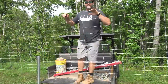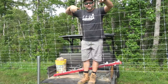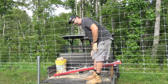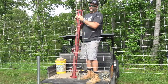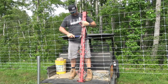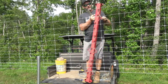Up we go. You can see how high this wire is — it's pretty bouncy and it is super duper tight. There's no way — I weigh about 260 pounds — there's no way I can pull this down on my own. So we get our wedge type strainer board here, pop all these wedges out. We're about two feet from the post here and we're going to put our wedge strainer board up here.